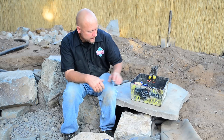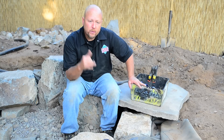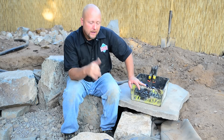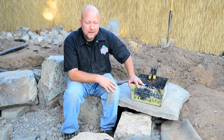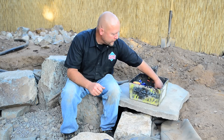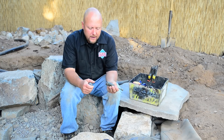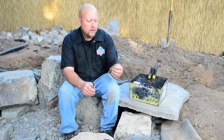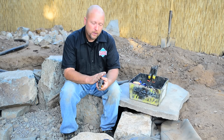The first tip is a contractor tip. This is our faceplate seal box — we keep it in a tote in our truck at all times, and when someone is getting ready to do a faceplate seal, they grab the box and have all the tools necessary. We're installing the Helix pond skimmer today, so the main tools we need are a Phillips screwdriver, a 7/16 nut driver, and an awl to poke through the liner and find the holes where the bolts go.